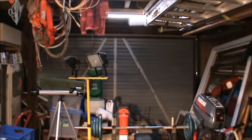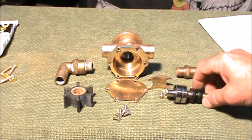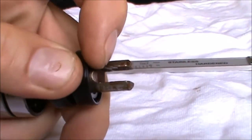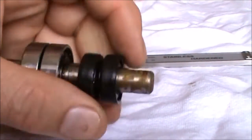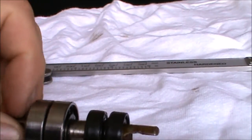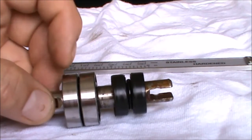I did this job in March 2014. The water pump had 1200 hours on it and I was mainly interested in the drive shaft and these components here. The drive shaft itself had a little bit of deformity, a little bit of wear from probably a non-genuine impeller being installed over a number of years in the past. A little bit of free play but it doesn't seem to be enough to worry me, and a new shaft is $300. So providing once I pull these other components off that the shaft's still in good order, I'll just refit it with new components.